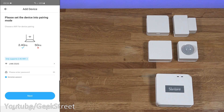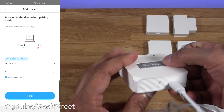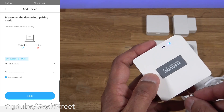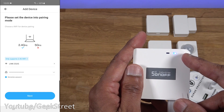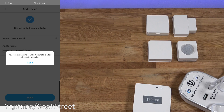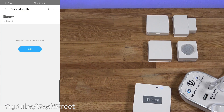It's a bit strange that I had to select the Wi-Fi manually - generally apps ask for location permissions automatically. Keep that in mind if you have issues picking up Wi-Fi. After entering the Wi-Fi password, power up the Zigbee bridge using a micro USB cable. Press and hold the pairing button on the back with a pin for about 10 seconds until you see one long flash and two short flashes. Then click 'Next' on your phone and it's added in successfully.